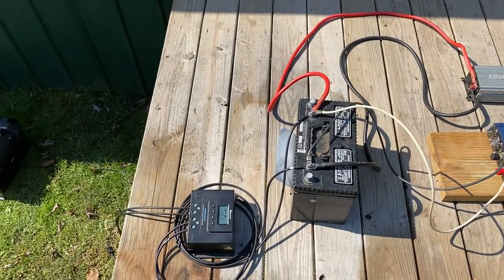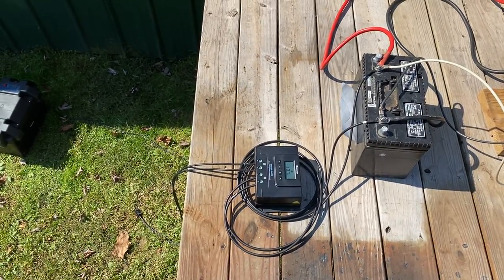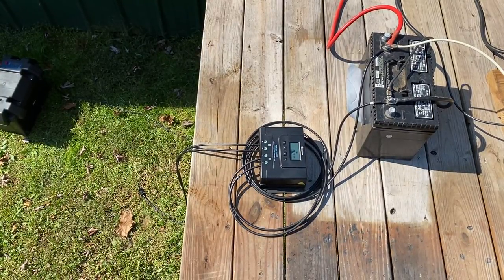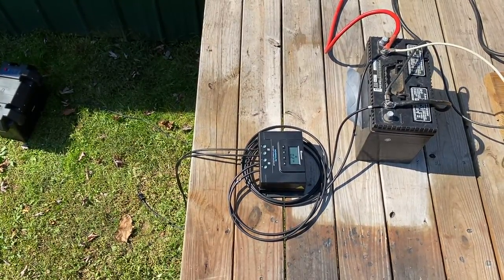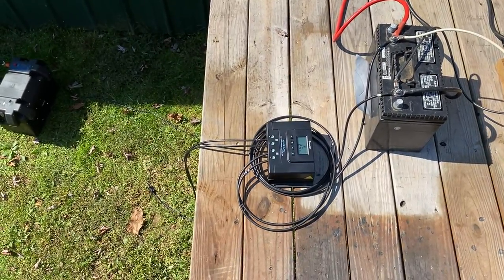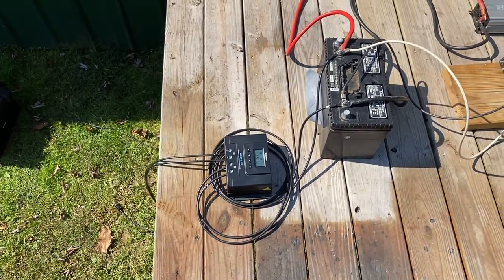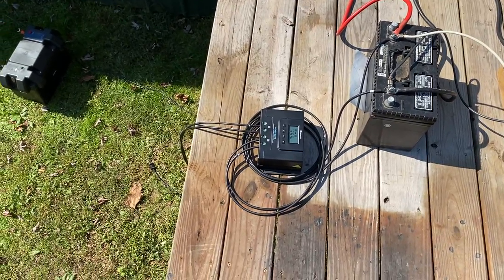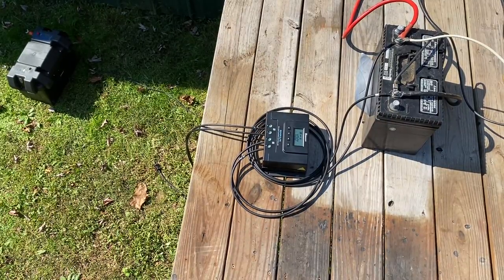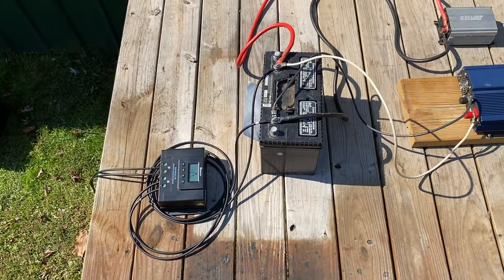You don't want to oversize your system or undersize it. As far as the solar charge controller, I thought I was going to be able to run six solar panels off of it at 40 amps, but that's wrong because each one of these 100-watt solar panels is running 7.5 amps, which equals 15. So I'm going to be able to run about five. I was going to buy a 20-amp, hoping I could run four, and that wouldn't have worked either. Make sure you check them — just because the solar panel says one thing, it's like 5.89 amps or something. It's underrated on the solar panel.